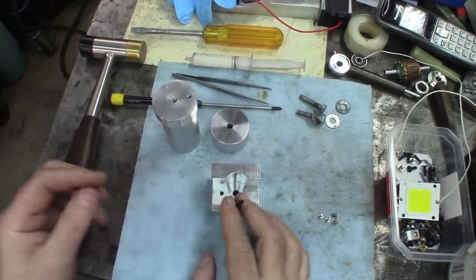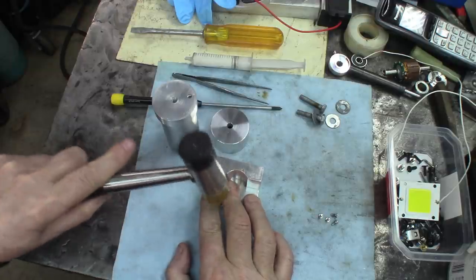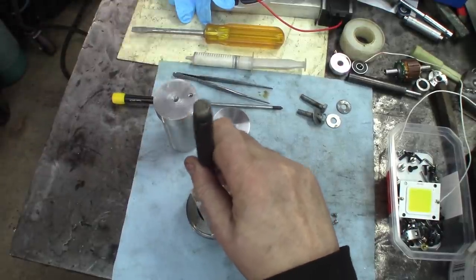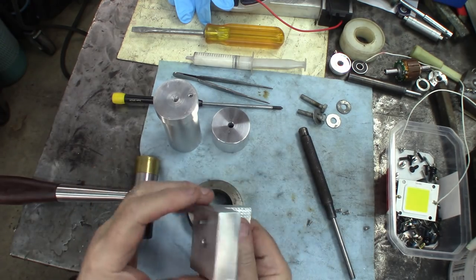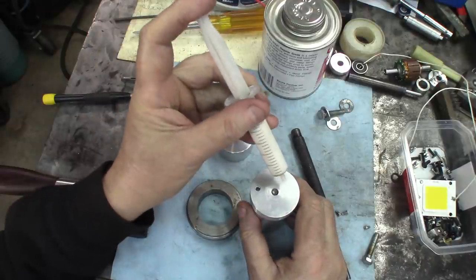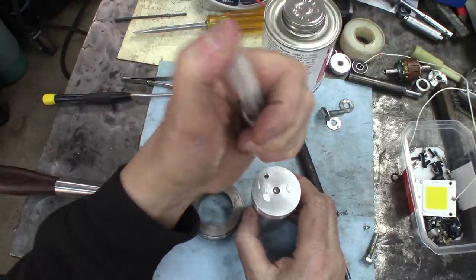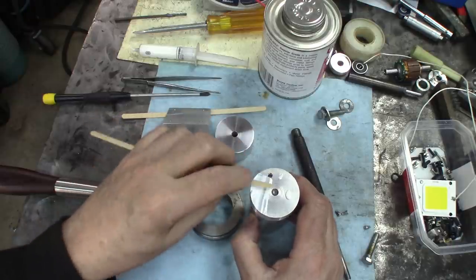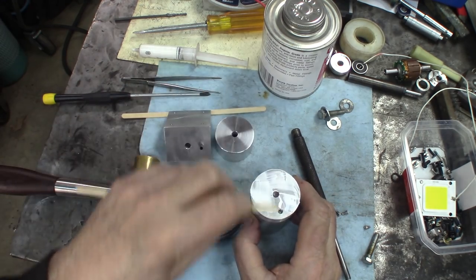Okay, as they say, assembly required. This is the spring pin that goes into this — I'll try not to knock my fingers. That's a little bit more clever; that's going to go better. Okay, that's recessed. I'll do some fixing a little bit after this. Next step: this special paste for the heat sink. All you need is enough to make a very thin coat — the thicker the coat, the worse your heat transfer is going to be. So let's add just about what's needed. You really have to spread it very thin and let the pressure do its work. I can't rotate it because of the spring pin, so I'll install it here.